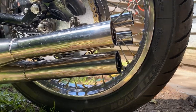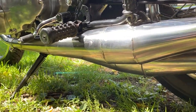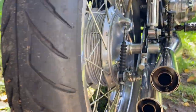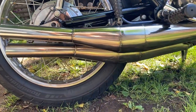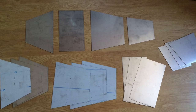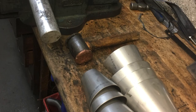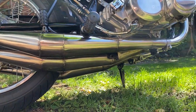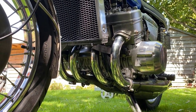I made a four-into-four stainless steel expansion chamber exhaust system for the Kawasaki 500 LC, and I like to tuck my exhaust systems in so they fit closely to the bike. Little flat sheets of stainless are cut out from cardboard templates, then they're rolled up around a piece of bar using my hide hammer and TIG welded together. The front header pipes are from a Kawasaki H2B and fit just perfect.